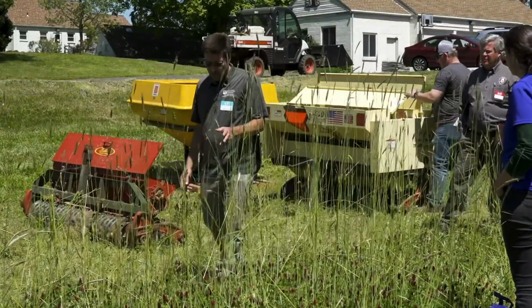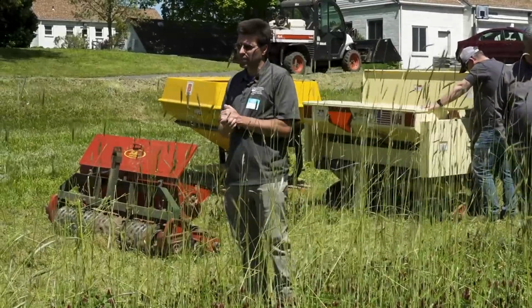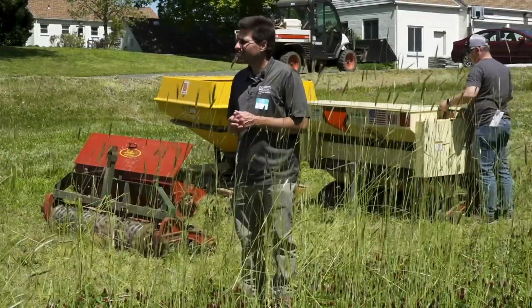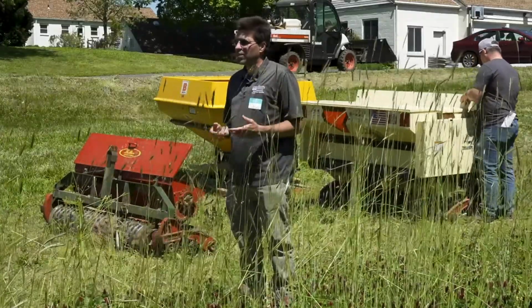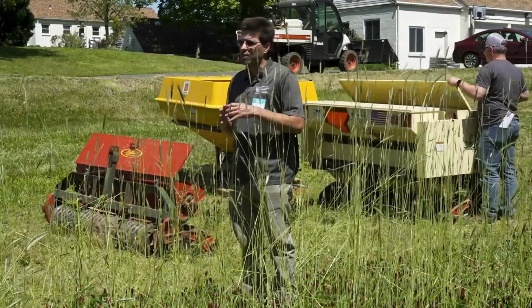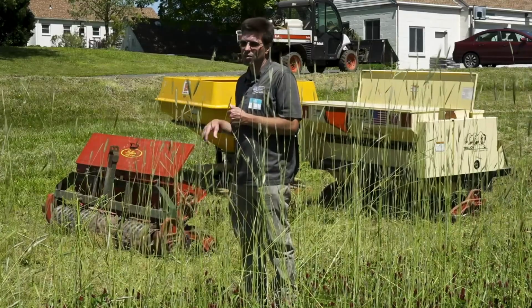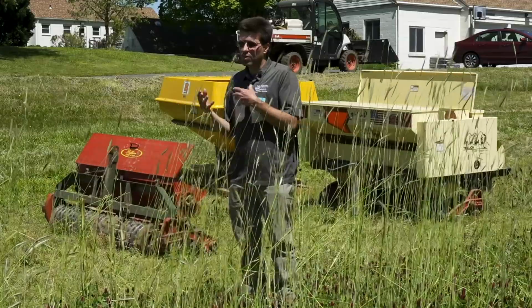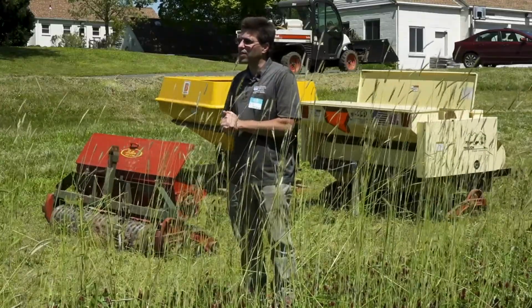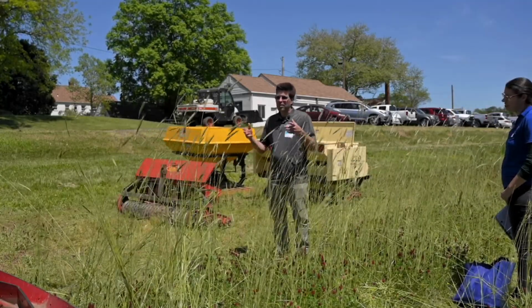That middle box there, we often haven't used that middle box because if you're planting native seed, you're often planting a low seed rate, and you often need to bulk up the seed anyway. If you don't have a lot of fluffy seed in there, often bulking it up will fix your problem with the fluffy seed, and you don't really need to use the middle box, which is tricky to use. So you're better off just using that front large seed box with bulked up seed, and it works a lot better. This is something that we've talked about in the other groups, the bulking of seed. Has anyone run into that issue and needed to bulk up seed because the seed rate was too low for the piece of equipment?